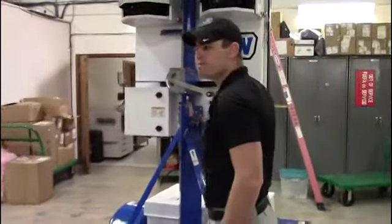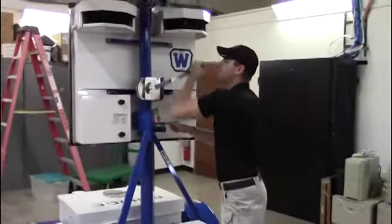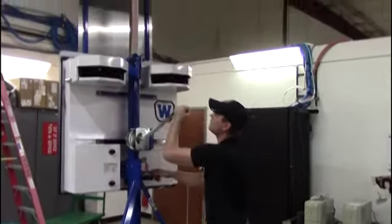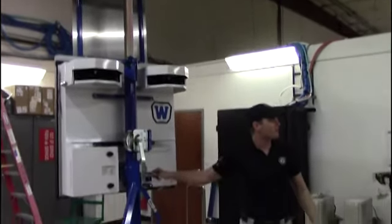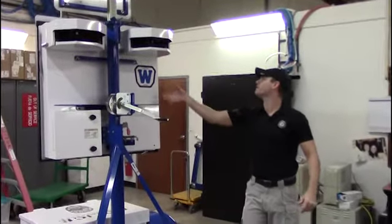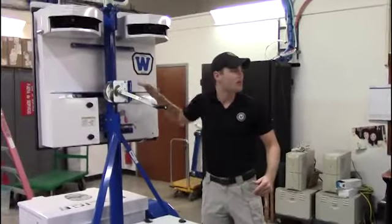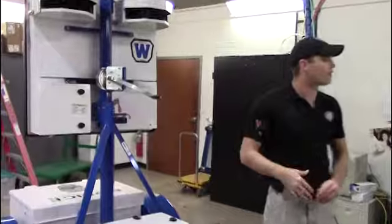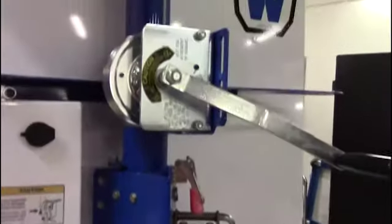Pull out on this pin and crank the hand winch up. You'll feel it lock into place after it goes up a set amount. If you stop there it'll block a little bit of the front of the sign, so keep going up. There's a safety latch — if this cable ever snaps, it has a stopping point, but that's not necessarily where you have to stop. The clutch on the winch itself will hold everything as far up as you want it to go.